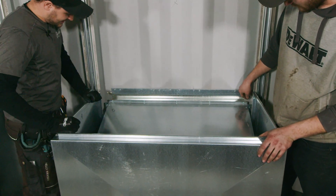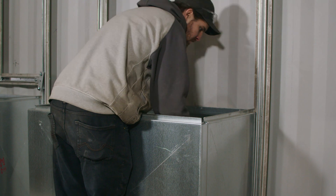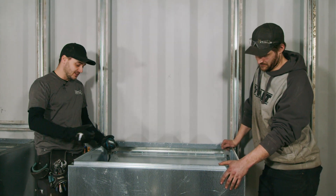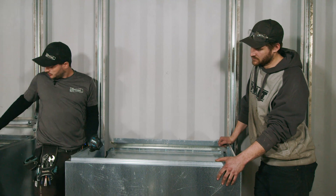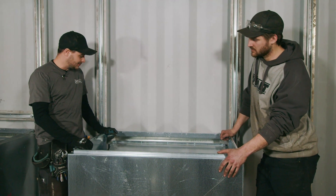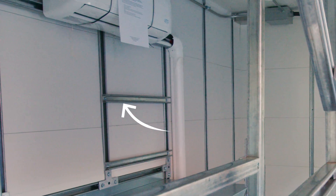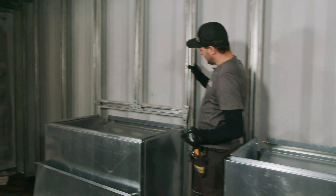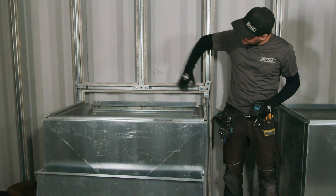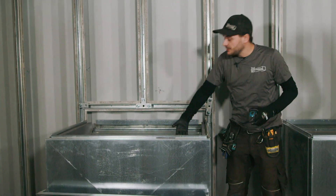That would be right here with that self-tapper. And you didn't have this top plate on right away — that was on last, it was the last thing you do. You also stuffed insulation in. There's two inches here and four inches there, so we're able to put rigid insulation in there because that would be very difficult to spray foam. Then we'll be able to just spray foam the top half. The heat is going to rise, so having that spray foam would be nice. It'll come right inside the header and then all the way up the walls, so the re-line comes up and finishes nicely, and all the spray foam comes around all of this and makes a perfect envelope.